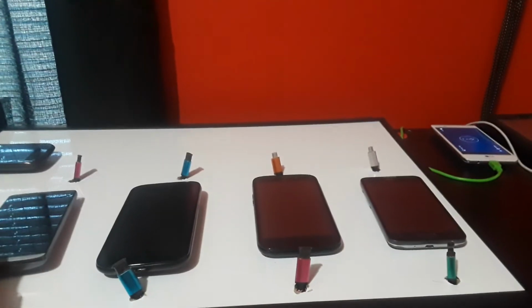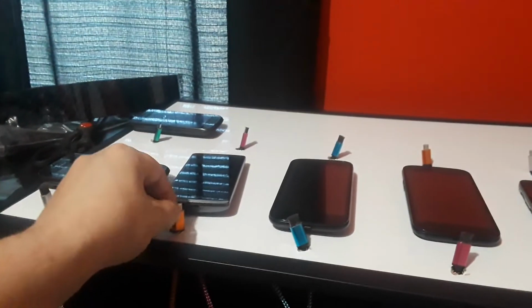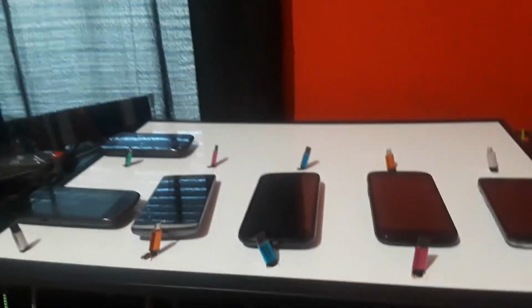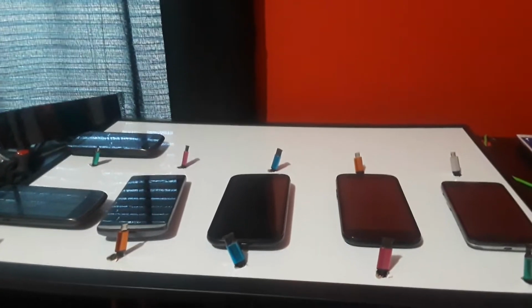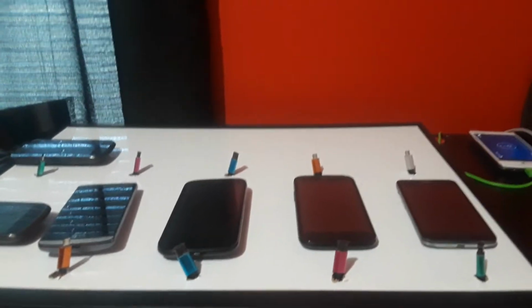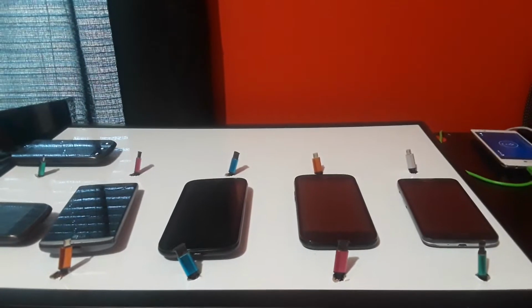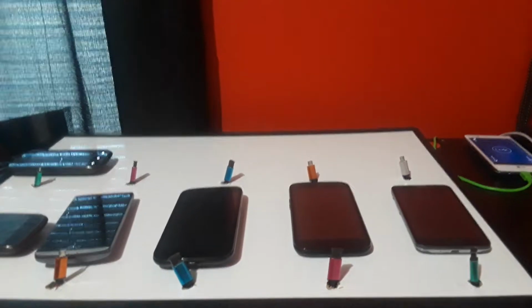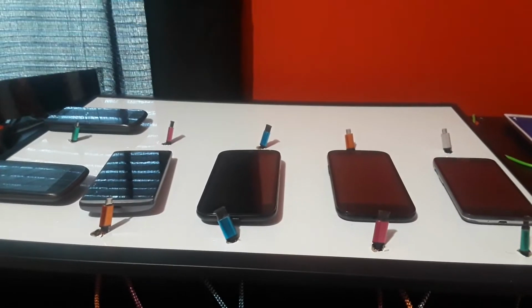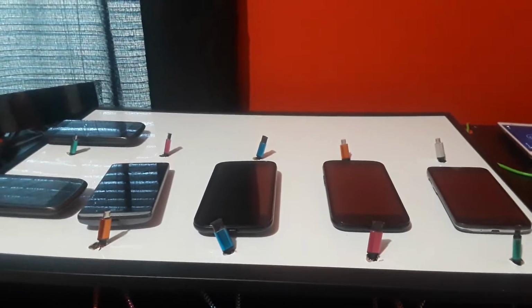Make sure that the holes aren't too large, so that you have to push them with a little bit of force to go through, but not enough that they're going to get stuck in the hole as you're installing them. Just one of them little tips that can save you a bit of a mess if they start to fall out the back of your board, if you're doing that with a different type of board or something like that.